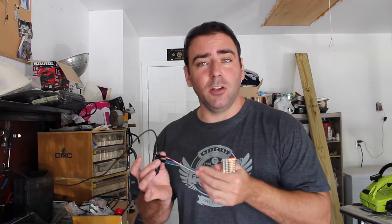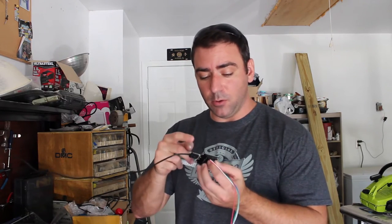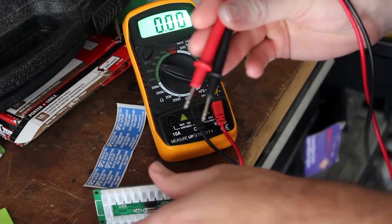Right now I'm powering this off just a cell phone charger — it takes 5 volts in — but I don't want to have two power cords coming out of this. I want to power it all through USB and I don't want two USB cords coming out either. The board for our game controller does have some extra pins, and one of them is labeled 5 volts. I'm thinking I can get 5 volts off of that, and instead of using the USB port on the development board, there are VIN inputs on here, so I can connect straight to this. Let's see if I can get 5 volts out on that.